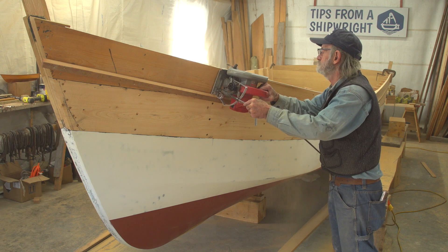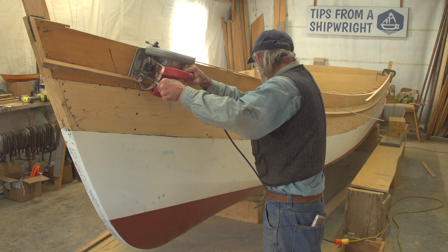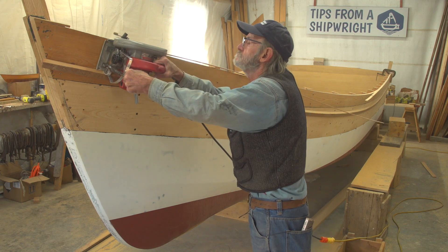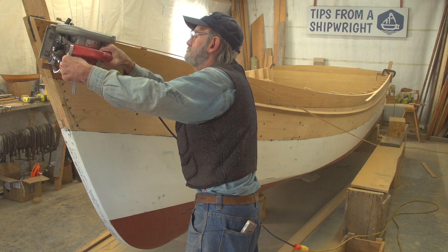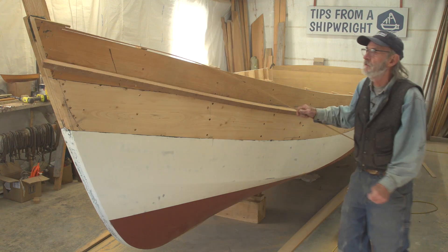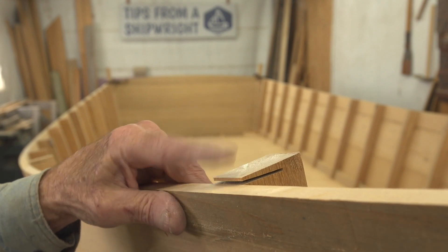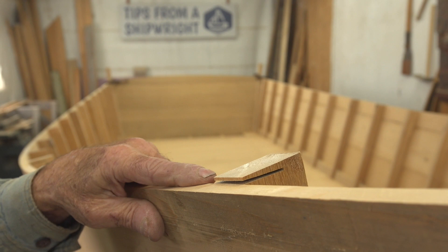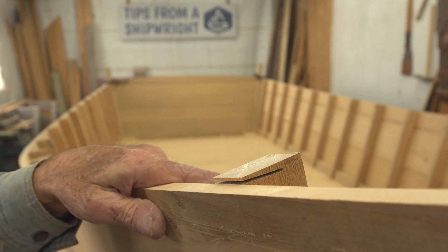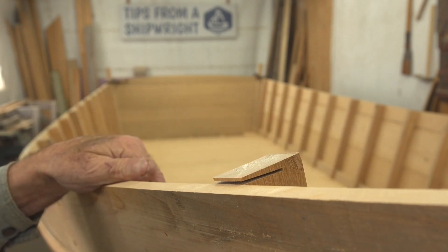You don't want the thing flying out of there or otherwise. Up forward here, there's not much of a progression in the cut at all; most of the progression is from amidships aft. You can see how I cut it off the first time — it was 90 degrees to the plank and now I've recut it, I cut 10 degrees off of that. So it's got a 5 degree uphill angle and you can see how much difference it is right there.